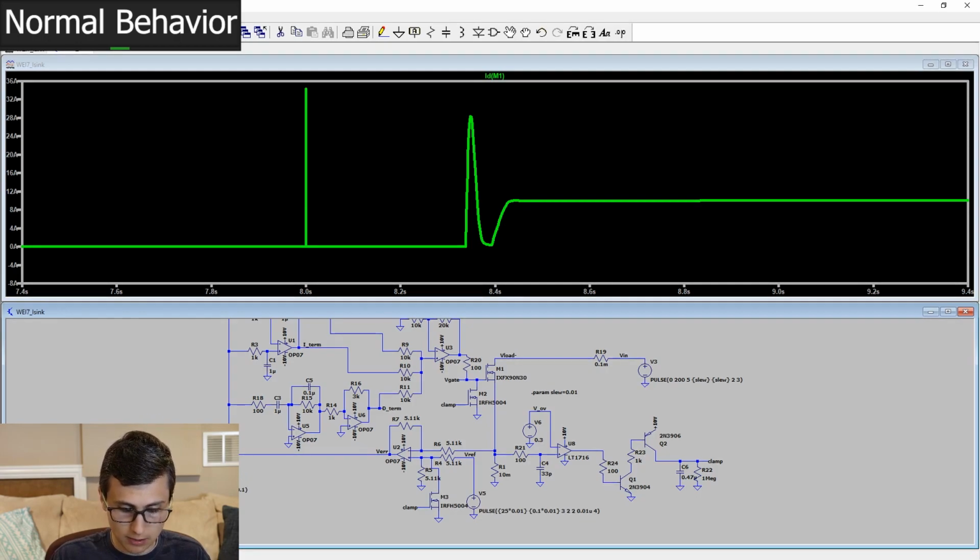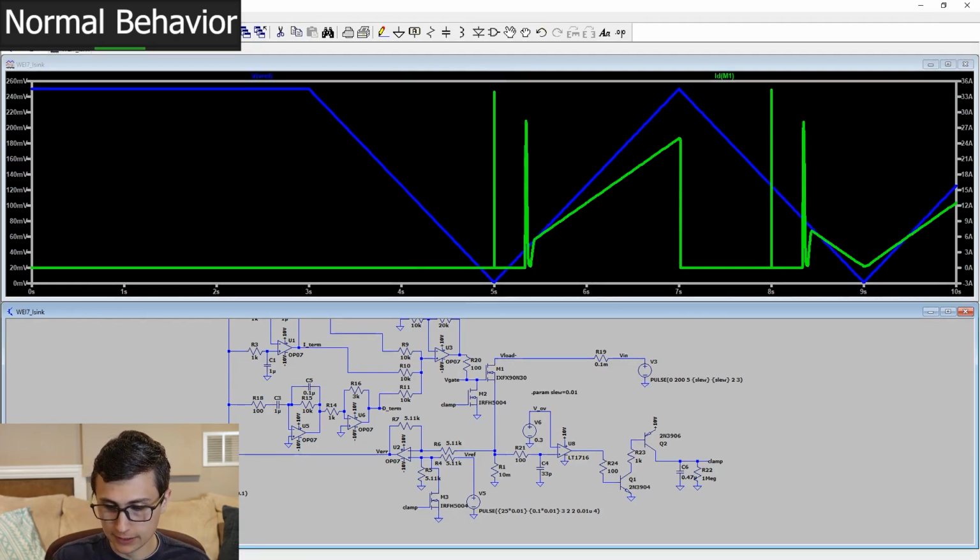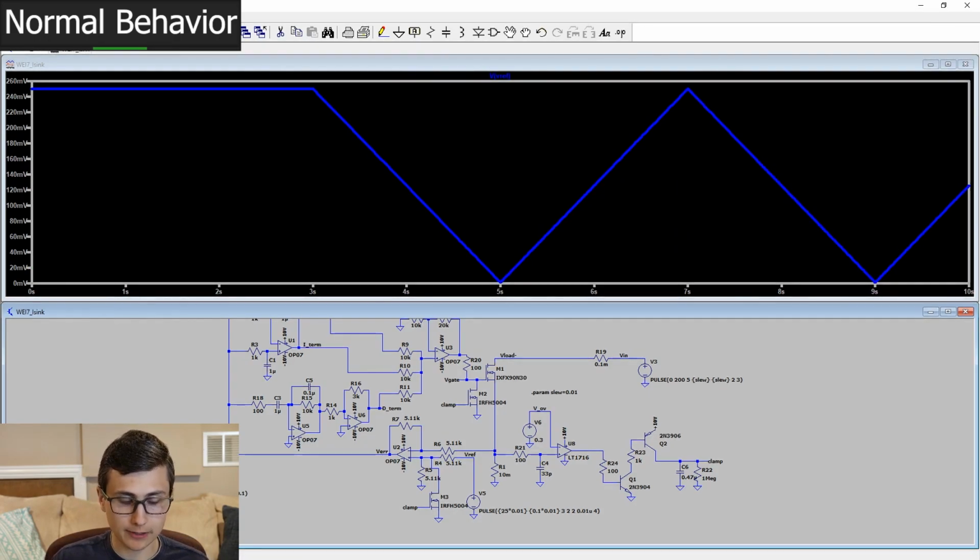We're going to do that by dropping one over there, the other one over here, and we're going to hit go. And this is going to be pretty cool because what we're going to see is how we are driving a waveform. Oh boy, we're getting stuck with stepping the source. There we go. So you can see the input waveform that we're asking for. We're asking for 25 amps going down to 0.1, back up to 25, back down to 0.1.